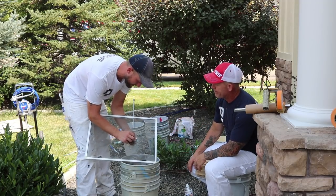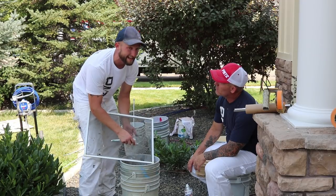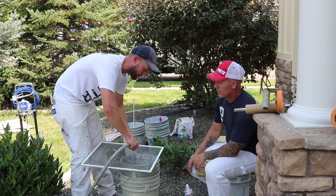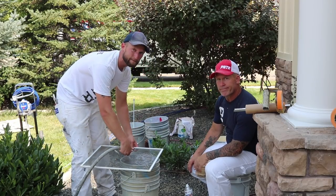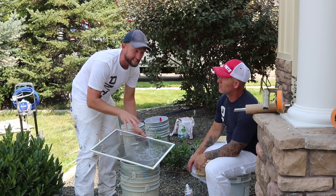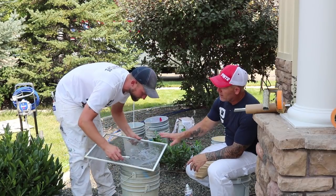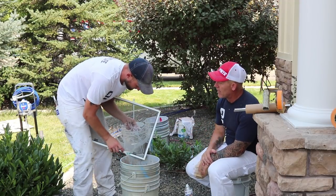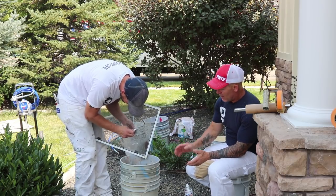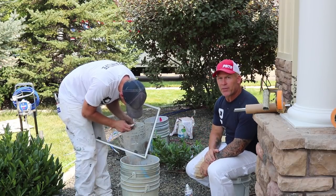John's continuing to work it with just cool water — no soap, no chemicals. Usually if someone catches it early enough they can take care of it with just water. You want to use the ammonia from Dirtex sparingly, because especially if the screen is faded it's going to discolor it. This is a fiberglass screen, about 15 years old and fairly oxidized — if you start with too much Dirtex you could eat right through it.